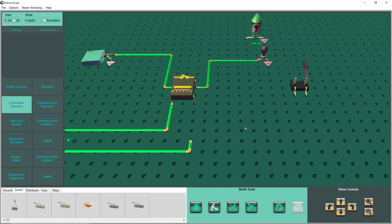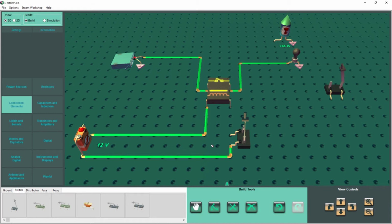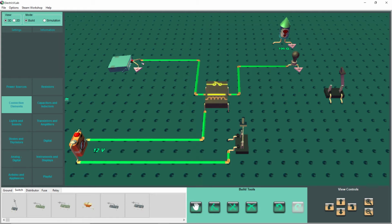Hey, you know what? Let's make a copy of this switch, duplicate it. We're going to put another switch over here, just temporarily, in line here. This is just for demonstration purposes. Something else would be making the voltage besides what we're doing with the switch. But this is just to show that we apply the voltage with the switch. And when it does hit the coil, it will pull in this contact to let the AC power flow through to the light bulb. Okay, so now we need another piece of wire to go from here to here. So you can see now the coil is right across the battery, except the switch is in between.